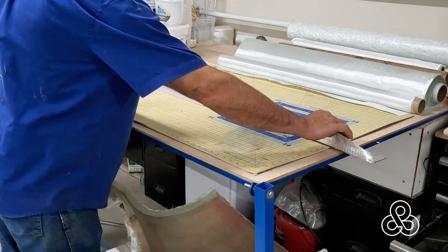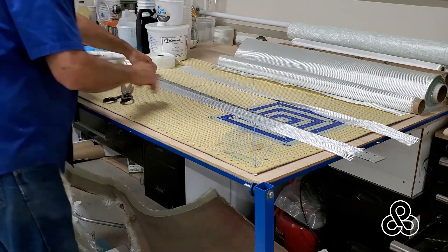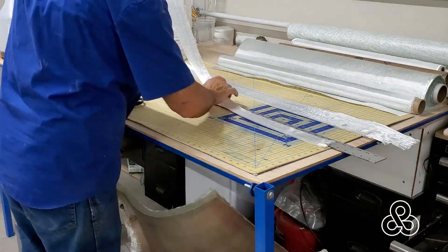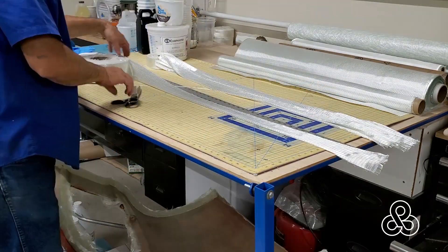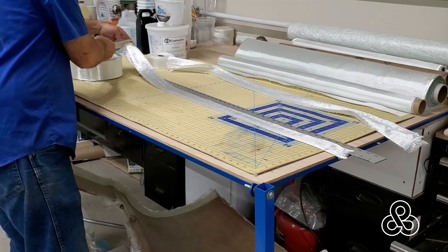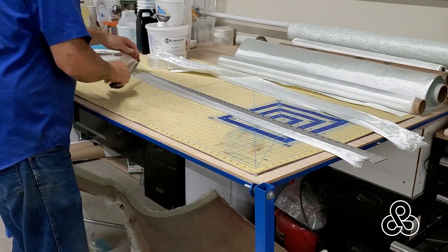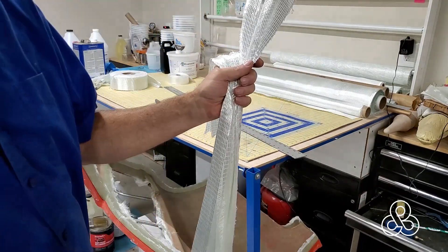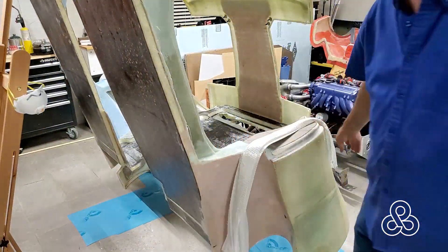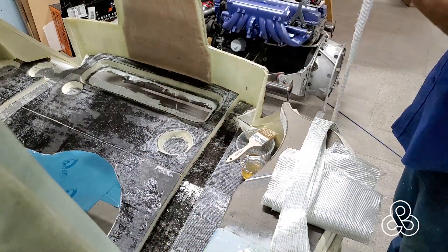What we're going to be doing today is laying this unidirectional fiberglass tape. We're going to put down about 14 layers in this video. The first round is eight layers, cut off and measured out to be about 48 inches long. I have this nice little measuring stick to guide me — pull it off the roll and cut them off. Once I've got 14 layers, we'll haul those over. With the car standing on its end, we've got a nice little shelf here at the door seals to lay those for easy access to grab them and go. Then put some resin down and start the lamination.